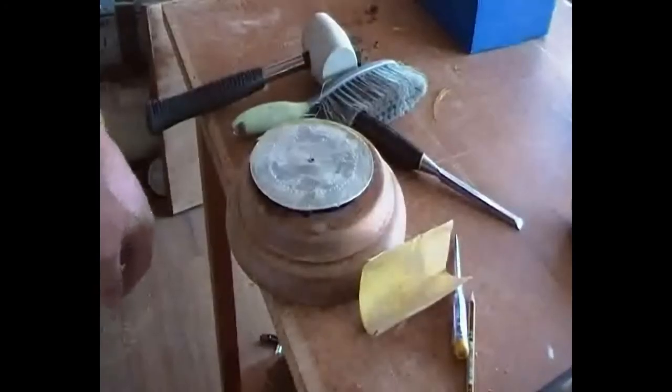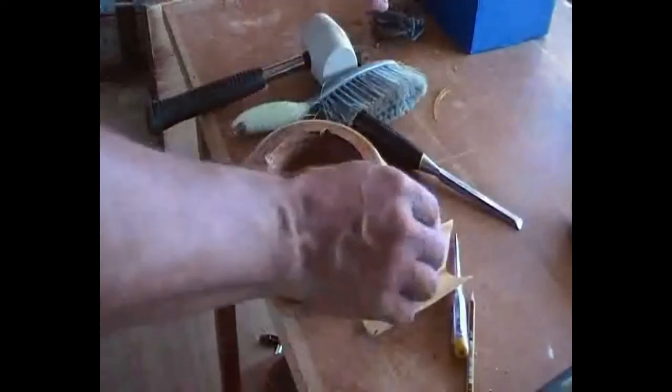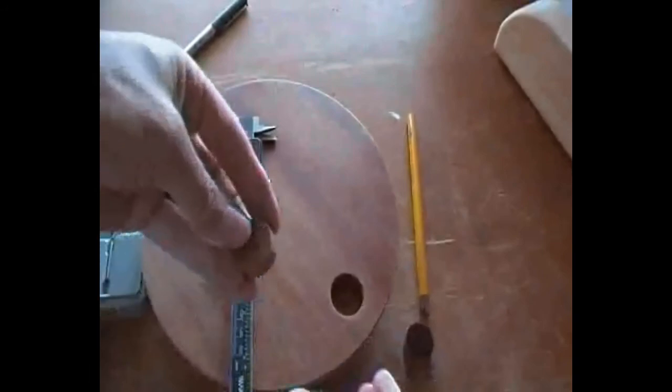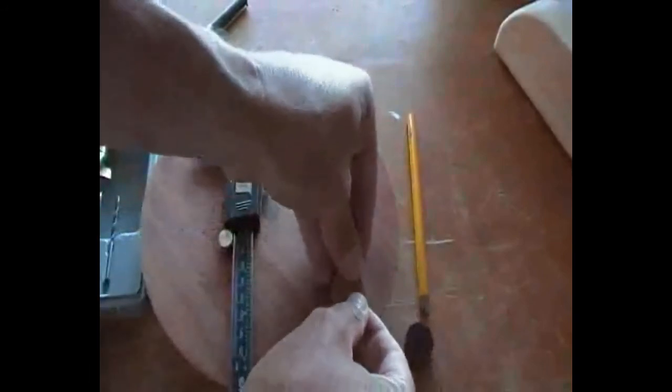This is an old barometer I'd had hanging around for a while — it didn't work and was in pretty poor condition, but it was beautiful timber, I suspect teak or mahogany. There was a hole in the back for it to hang on the wall, but I drilled that out fully so it would fit a dowel. I didn't want to put it all the way in — I wanted a very tight fit that would be sealed against the weather once I put the finish on. I used the bandsaw to cut the dowel down, and the dowel was that mahogany with a little spare square knocking about the workshop, so I just glued it lightly and pressed it in.